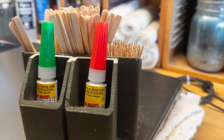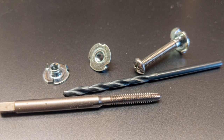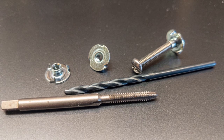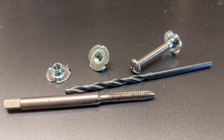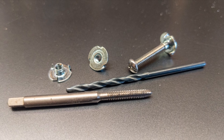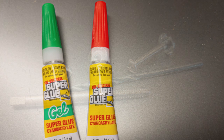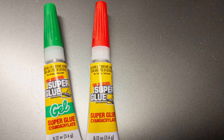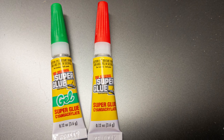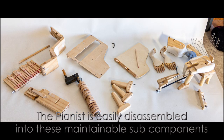The pianist was fastened using, in most cases, CA glue or 2-56 stainless steel machine screws. I rarely use nuts, preferring T-nuts or blind nuts, which I superglue in place. I've been known to drill and tap wood so that I can fasten directly into it. When I do this, I treat the tapped threads with CA glue — it soaks in and strengthens the threads and makes the tapped threads very reliable.